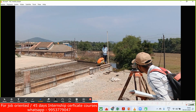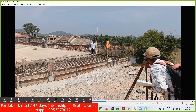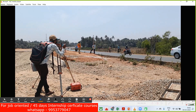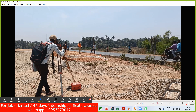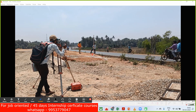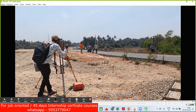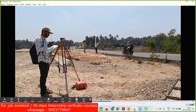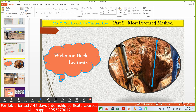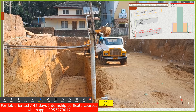Here is another video. Let's say this is the top of a curb stone and the RL is a temporary benchmark. Let us consider it to be 100.35. Now from here you are going to get one staff reading — 100.35 plus whatever reading you got — and that you add to get the height of the instrument. I hope this much is clear for you.